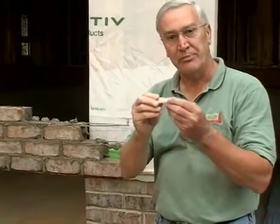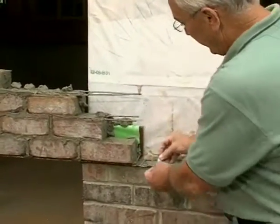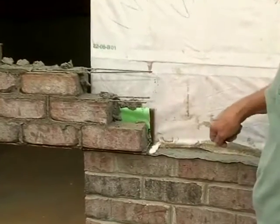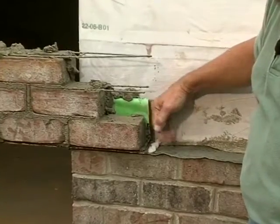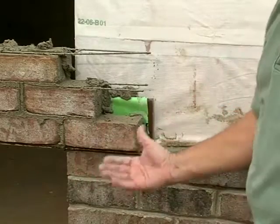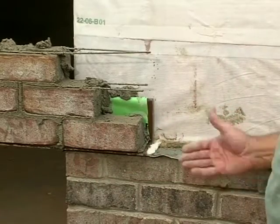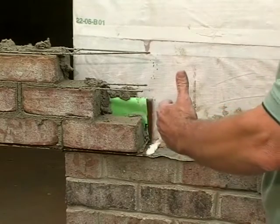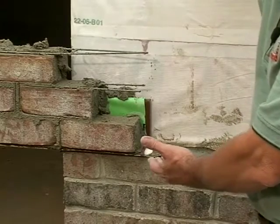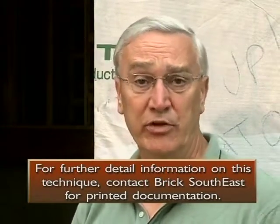I picked up a little piece of insulation here on the ground, but any type of compressible material laid against the end of that angle iron when the mortar is being spread will do. Once the brick are laid, there's room for that angle iron to grow in and out daily as it expands and contracts thermally without pushing the brickwork. This is only a problem with a short return or if you're up close to the cornice. A small piece of compressible material at the end of the angle iron, ensuring it's not bound too tightly in the mortar and has room to move, will do the job.